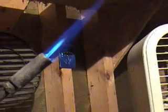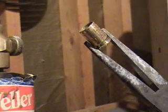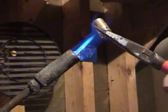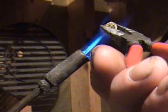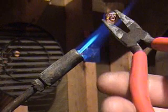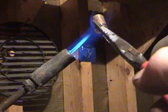The second step after trimming down your cases — that one's all nicely trimmed down and ready to go — is to anneal them. What I've been doing is just heating these suckers up cherry hot, since it doesn't really matter how soft they get. It's not like I'm going to be resizing them and firing them again. The softer the better performing, in my opinion.